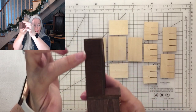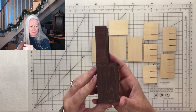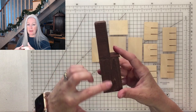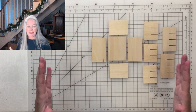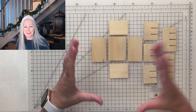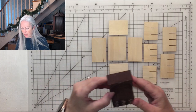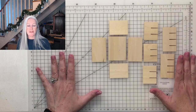You can see the grain of this piece is going one way, and the grain of that piece is going another way — but now I've stained it. The stain does bring out the grain but it's a bit hard to see on camera. It doesn't matter much for these pieces as they're going the same way. You do see it more when you stain it, so bear that in mind. You can reorientate pieces in Design Space if you know the wood grain is going a certain way, but if that's overwhelming, don't worry — by the luck of the draw it'll look fine anyway.